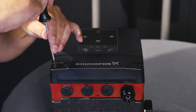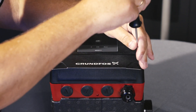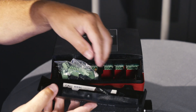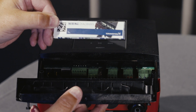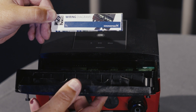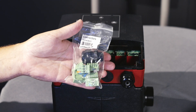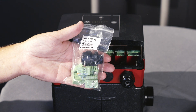The first time you take off the cover on the Mixit unit, you need a Torx 20 and two screws, then take the cover off. Inside the cover we have a mini quick guide and a wiring diagram. In this wiring diagram you can find a lot of information regarding how and where to place wires from different sensors and so on. Inside the Mixit we have this back panel with all the terminals and a cable gland if you want to use more cable entries in the system.